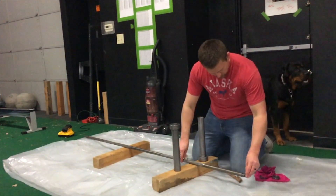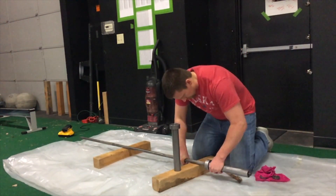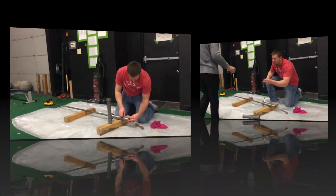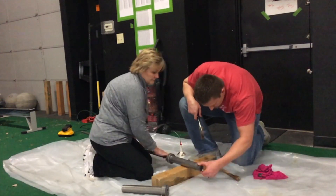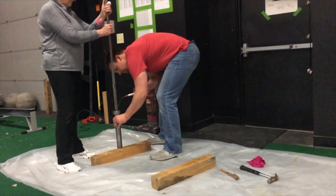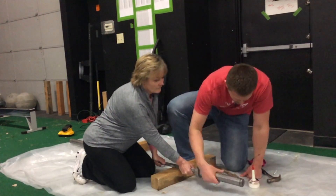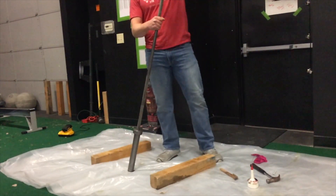When that is finished, it's time to reassemble your bar. First you'll see me put the o-ring back on the end of the bar, then sliding on the sleeve of the bar. Then you get to start the fun process of trying to get that end cap lined up — you've got to get the hole in the end cap lined up with the hole in the shaft of the bar — and then you're gonna work on tapping that pin back into place. It takes a little bit of time but you'll eventually get it back in there. Once both ends are reassembled, apply some oil where the shaft meets the sleeve and where the sleeve meets the end cap. I'm probably overdoing the oil application here, but this bar has been completely cleaned with no lubrication, and you can always wipe off the excess, so it's not that big of a deal.